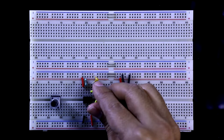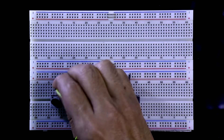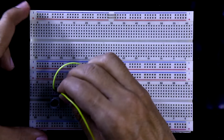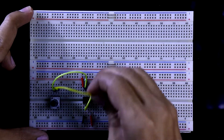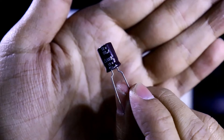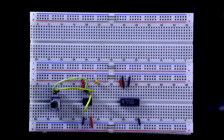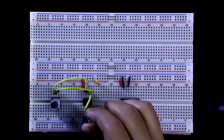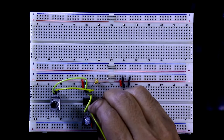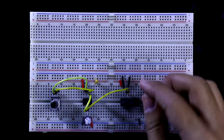Pins 6 and 2 are connected together. I am connecting the middle pin of the potentiometer to pin number 7, and one side of the pin to pin number 6. Now I am connecting the 100uF capacitor — positive pin to pin number 2 and negative to ground. Pin number 3 of the 555 is connected to pin number 14 of the 4017.